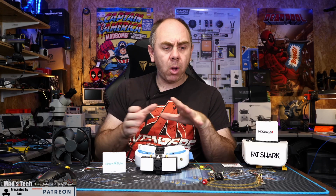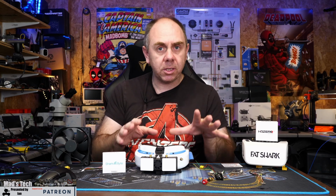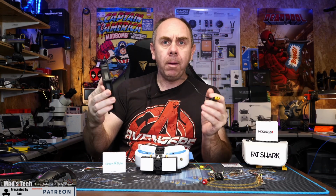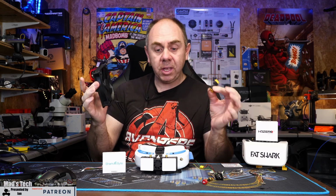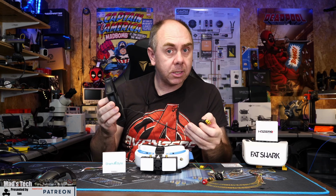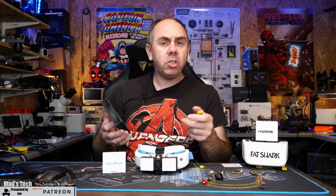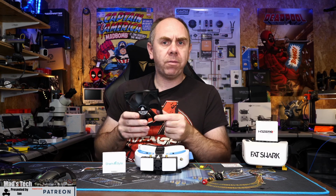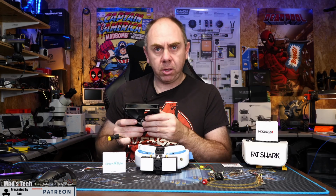Furthermore, parts of this system also get quite warm in the update too, and I like to have a fan on site when doing updates just to try and keep the system cool. I have actually built myself a plug-in LiPo based fan based on a 40mm PC fan with an XT60 pass-through, and I use this a lot of the time whenever I'm testing the system on the bench or performing updates, just to get some airflow over the system whilst it's working. What I would say is just keep an eye on things, and if you don't have access to a fan, just make sure that the temps aren't getting too hot as the system is processing through the update.